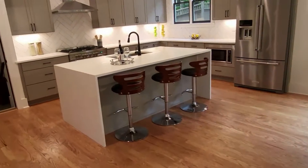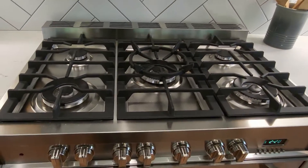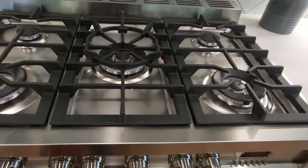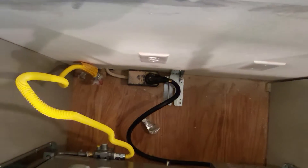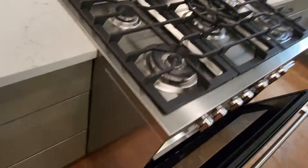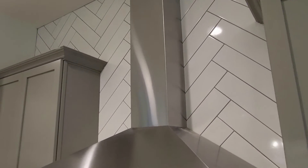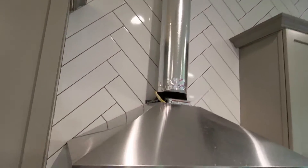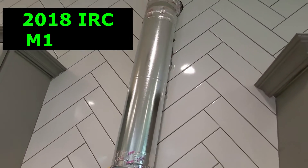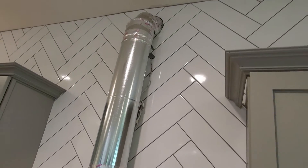Let's move on to the kitchen area. There's your gas range. I need to check to make sure there's a shut-off valve behind there, so let's pull this thing out. There is a shut-off valve behind there. I also check to make sure that's not a flex duct up under that cover. I took some time and took off that covering above the kitchen exhaust — there's your hard duct. That's what you need, that's what it should look like, not flex. And it's terminating on the exterior.